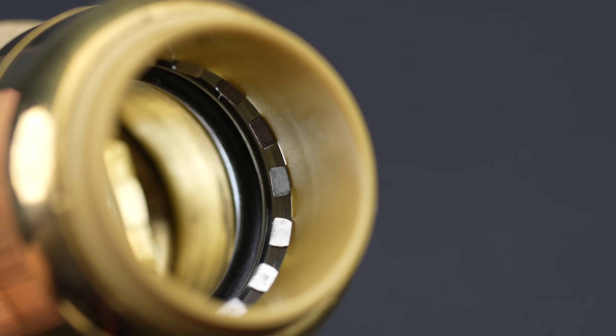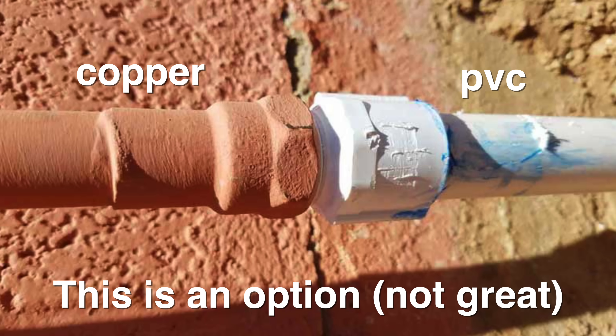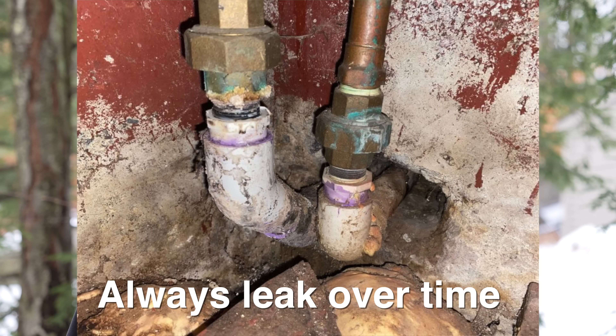SharkBites use a metal ring along with an o-ring, and on a main connection you don't really want this pipe moving or having any kind of vibrations that could make that connection come apart. You'll typically get plastic pipe coming in from your street or from something like a well, and your house itself might be using copper plumbing. You could use threaded connections and just tighten them up, but anytime you have threads, even with good sealants, you could have a leak.